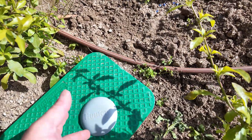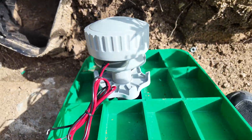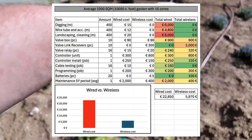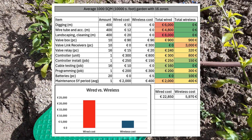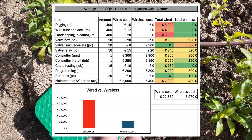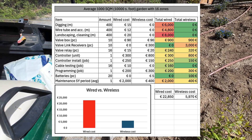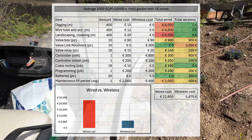And if you believe it or not, those things are not so expensive. This one which has only one output is about $280. There is a version with double output, and also a version with four outputs. When you arrive at the four-output module and can manage four or two irrigation zones in one box, everything flips nicely. The two-channel is about $320, and the four-channel is less than $400. So you arrive at the point of about $100 per valve to control it centrally — and you cannot compare that with cabling, tubing, digging, reorganizing your soil, and all the concrete work you have to do after.